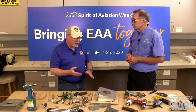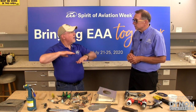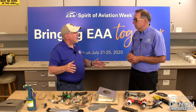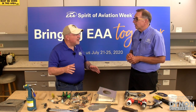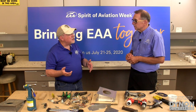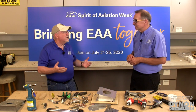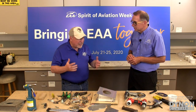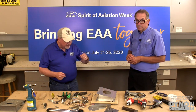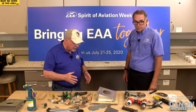The other thing is, on the large sheets like your wing skins or your fuselage skins, they'll have the whole sheet protected with plastic. Sooner or later you've got to take that off, and the longer you leave it on there, the harder it is to get off. If the project is going on year after year, you want to protect your metal, but you also want to be able to get that off without going through a lot of undue stress. So it's a balancing act. Then once you get that off, you're ready to final assemble everything.